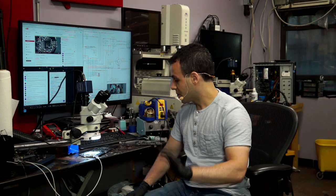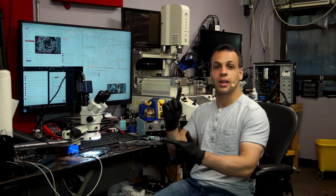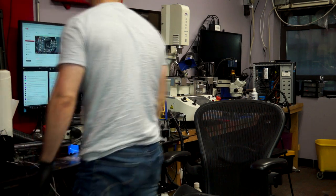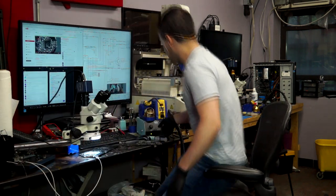Isn't that great? So that's how we repair a machine that's dead, not turning on. That is how we figure out if the DC inboard is bad or not. Before you even grab a new DC inboard, the adapter sense line will give you some good hints as to whether your DC inboard is good. What, 2.9 to 3 volts good, 16 volts very bad, charger voltage is making its way into the adapter sense line, and zero, anything considerably below 2 volts or like 0.7 volts means that it's not doing its job, it's not working at all.